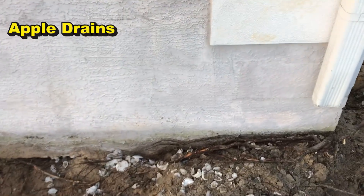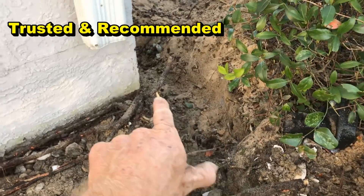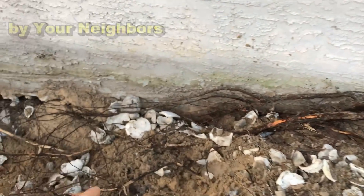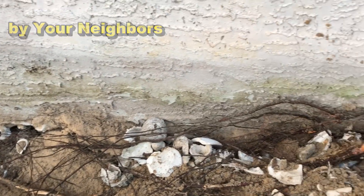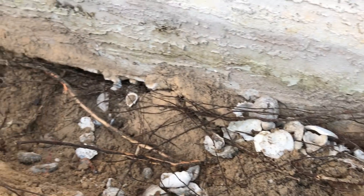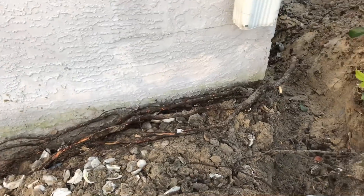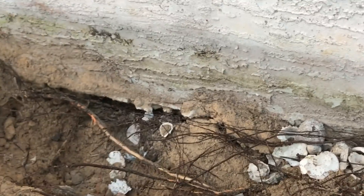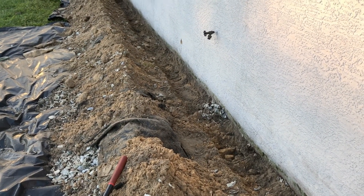While we're excavating, you can see what causes problems — tree roots, these from the Indian Hawthorns I removed. You can see how they're growing up under the stucco and into that footer, right underneath the floor. Water travels along those roots and comes right up through the floor inside. A real typical problem. The other big issue here is this concrete edging placed all around the outside foundation — although it looks good, it trapped the water and the water couldn't escape.